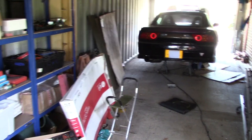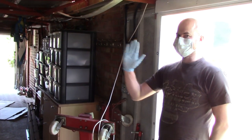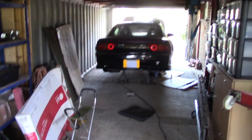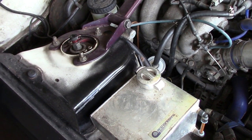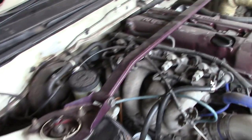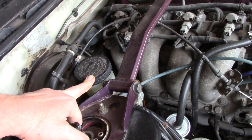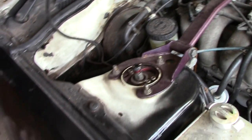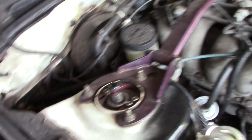Welcome back valued viewers — the brake lines and clutch lines are in now and we need to bleed them. Good friend Super T is here to help. We fill the brake reservoir with DOT 4 rated brake fluid, and DOT 4 in the clutch reservoir as well. Then you open the bleed valve on the slave cylinder — whether that's the brake caliper or the clutch slave cylinder.